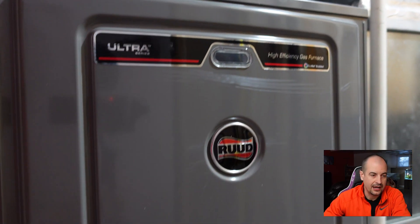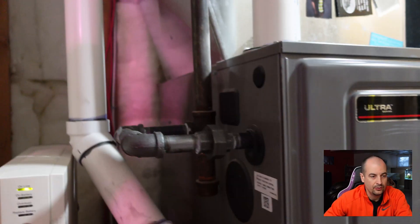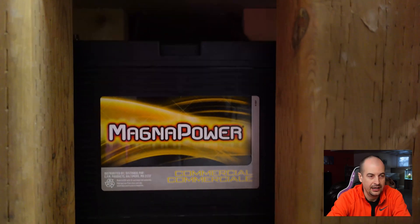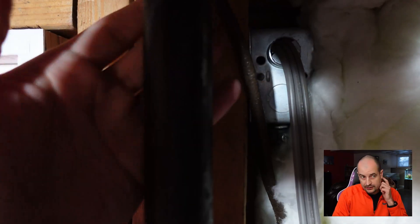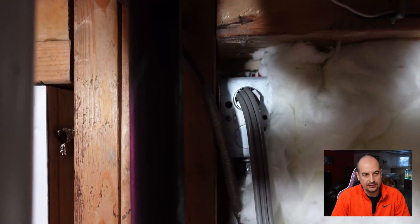Here's a picture of my current setup. My furnace is a high-efficiency natural gas unit, and I had an old APC battery backup connected to a battery bank of two lead-acid batteries as its power source. I wired it so that the power that normally went to the furnace went to the APC, and the plug at the bottom goes back up to the safety plug on the outside.